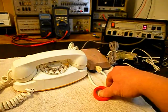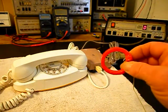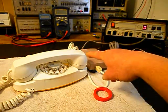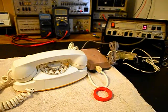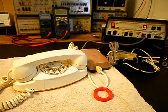Now, I also want to mention our amplified pickup. We use this in troubleshooting, repairing, and on our final checkouts. It's amplified so that you can hear the audio from a receiver. And I have an amplifier back by the video. It has a button on it. When I press the button, I can give dial tone or take it away at any time. And since it's an open amplifier, it is prone to any static interference or noise in the atmosphere.